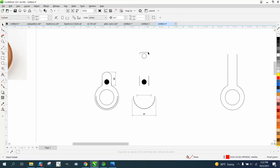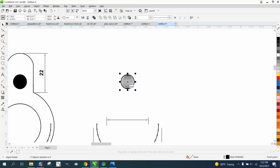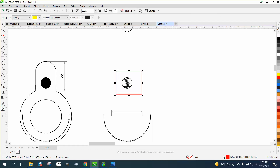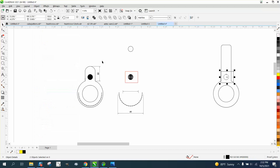You can see one of the problems right there — we have double lines. That's three lines right there. We don't need this line because we've already got a completed object, so we're just going to hit delete. If we take away the fill it's made up of a bunch of pieces. I'm thinking a snap goes in that hole, so the best way to figure out the hole size is to take a rectangle, use your smart fill tool to fill that in, nudge it over, then left click, right click, go up to Object, break the curve apart, and take away the rectangle.